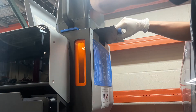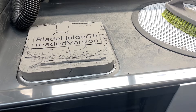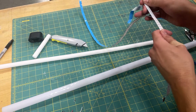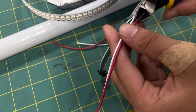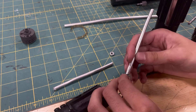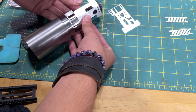The parts were all 3D printed on a nylon SLS printer. This is a special kind of 3D printer that works by fusing together layers of nylon powder with a laser. The blade was also made by me — it's a thick-walled polycarbonate tube intended for dueling in case my clumsy ass accidentally smacked it against something, putting the expensive high-powered NeoPixels at risk of breaking. The chassis also has many metal elements, such as rods that let the wires run to the blade connector mostly unseen. Since I don't have a metal 3D printer, to accomplish the look of metal housings, I laser cut several patterns out of thin sheets, bent them around a radius, and then epoxied them onto my nylon parts.